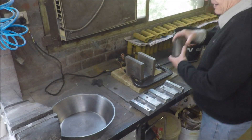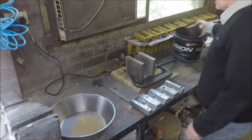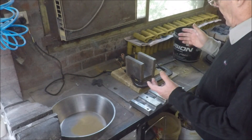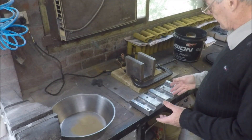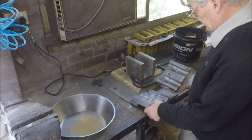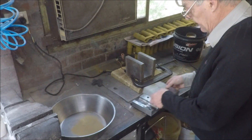The sand up front just looks like a dry sand, but it is in fact resin coated. The only drawback to the process is that you have to have hot moulds to do it in, and that means the moulds have got to be metal. In this case they're aluminium. These are the two mould halves that have been cleaned and just lightly coated with a bit of graphite.